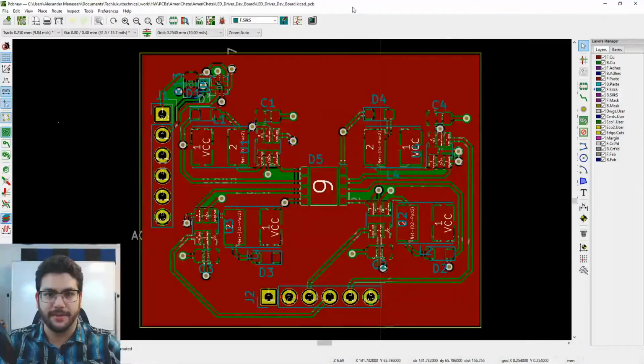I am building the circuit board that's going to have the LED driver. I decided to just go ahead and nix the whole MOSFET with a resistor to regulate the current. That was just dissipating tons of wattage, and it was just a huge waste of energy. Big problem. Don't want to do it. Forget about it. It's gone. Okay? So instead, we've got ourselves this.